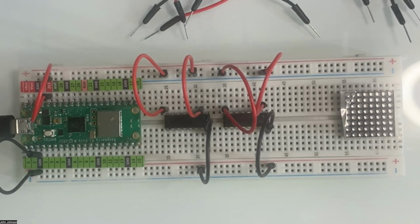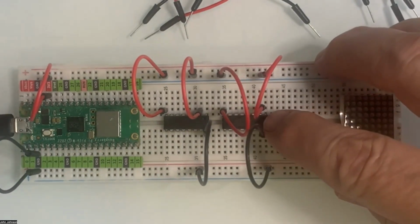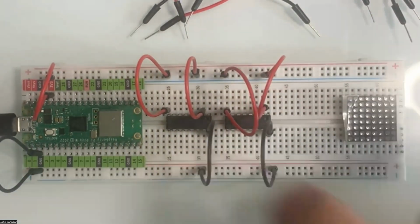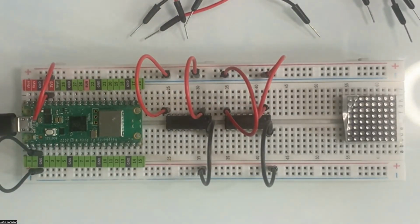And make sure you have it, because I've dealt with some people one-on-one in the last week or two that are being probably a little bit hasty and not realizing they've got power going to ground, ground going to power. And that's dangerous stuff there. When you've got the flow going the wrong way, bad things happen. So go ahead and do that. Get your power and your ground figured out first. Then we can start looking at the other pins.